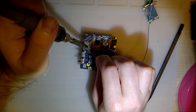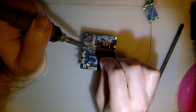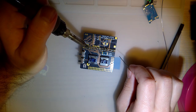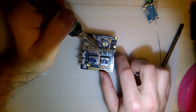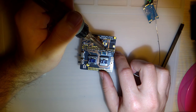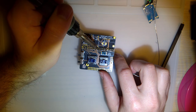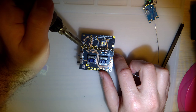One thing I do got to be careful with is this is one of the faulty boards. OSH Park just started up their After Dark production, and this board was part of their first batch, which went out using the wrong material, which means it's a little bit more sensitive to heat than it should be. Probably going to be fine because I'm not using lead-free solder, which means I am using lower temperatures, but just in case. Okay.